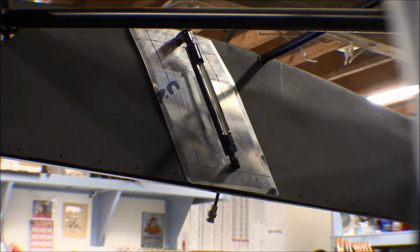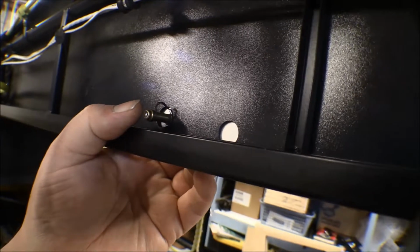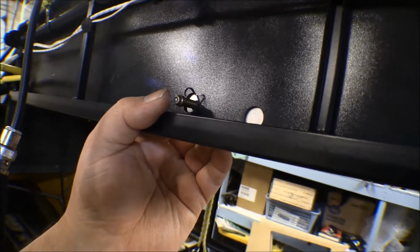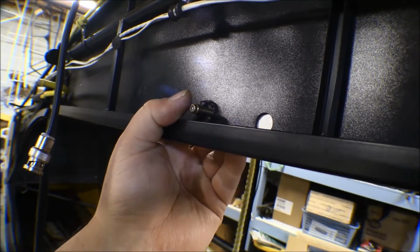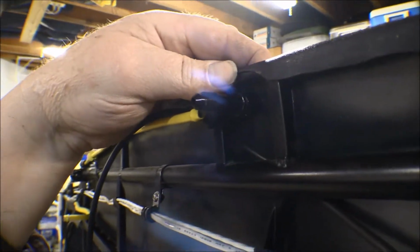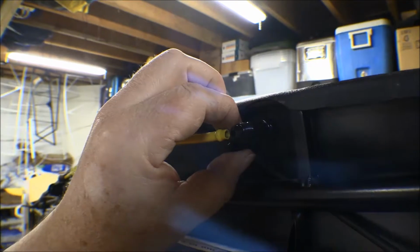There's holes along the bottom of the wing root panel that screws into that door sill. This is what it looks like on the back side of the wing root, on the inside or the outside or whatever. Anyway, here's the little hose barb. I've got a piece of 1/4 inch fuel line on that, a short piece on the inside of it to act as a spacer and to seal up around that hole where it penetrates through. And then there'll be a 1/4 inch hose that goes on this, and that can be pushed in tight against that to hold everything tight, and that'll go over to the lower line on the fuel tank. Up here we've got the elbow coming out of there, and that's just got an AN flare fitting on it, and then I've got this T on there, and that'll tighten up against it.